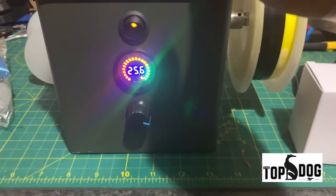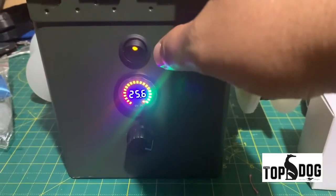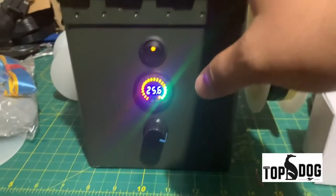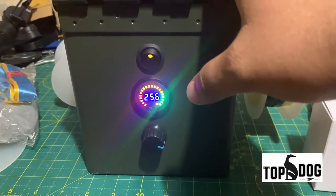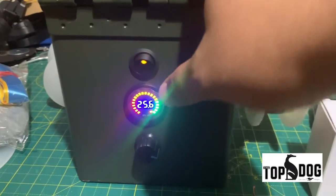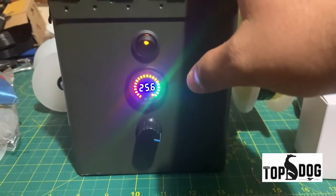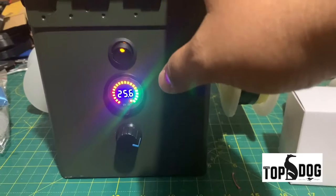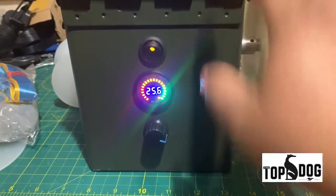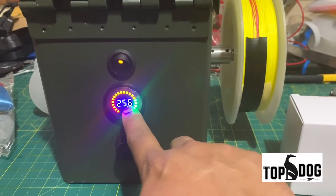It can get to the extent where it might not be able to recover itself when you put it on charging. This is just the property of lead acid batteries which are being used. You can charge it every day after every use — it doesn't matter if it is 80%, 50%, or 65%, you can still charge it every day. In fact, these batteries like to be charged as frequently as possible. I will share a V chart which shows what voltage indicates how much percentage the battery has left.